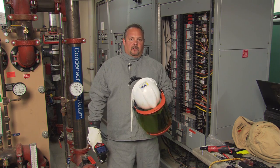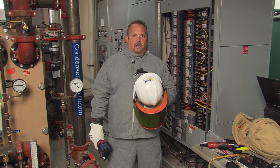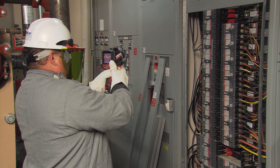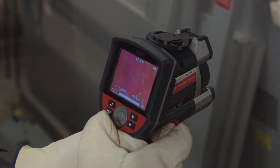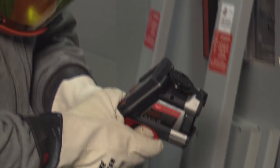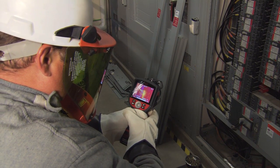Now that I'm not going to be in contact with the energized equipment, I'm going to back off on my PPE and go to a more comfortable helmet and face shield while I'm shooting with the thermal imaging camera. Working from the main breaker at the bottom, I worked from bottom to top in a clockwise manner, noting any abnormal heat variations. Then I changed my angle of shooting to make sure it wasn't a reflection showing on the camera — by shooting from different angles, you can eliminate that to determine if it's actually the equipment or just a reflection.